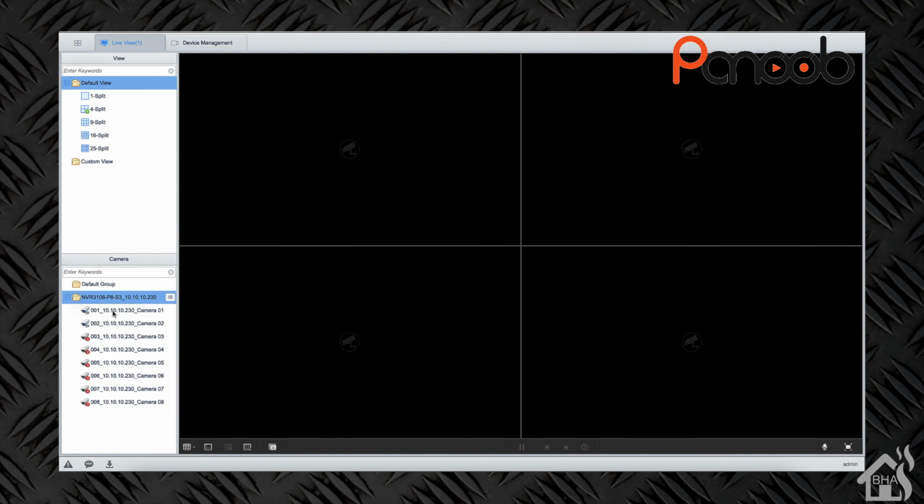I'm here on the Wi-Fi, so I should be able to access the local IP address. And as you can see, there are the two camera images showing up in live view. And if we click on those, we get the full screen view there as well. So that just shows you how you can set it up and the various ways that you have to set this camera system up. So that's pretty cool. Let's go ahead and move on to the next step, and we're going to see if we can't get these to show up in Home Assistant.